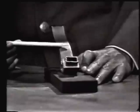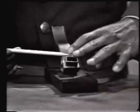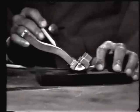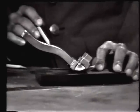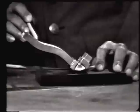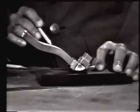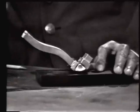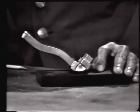You'll notice that the B-wall is the wide wall. Notice also that the bend is gradual. Remember that the radius of the bend must be at least 2 complete wavelengths to minimize reflections and prevent losses.